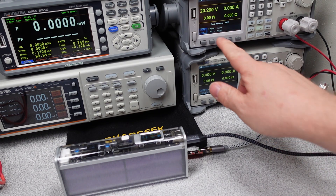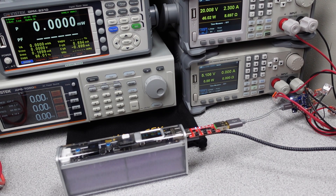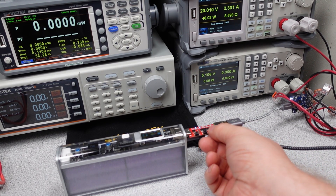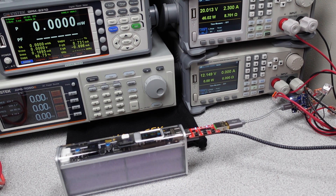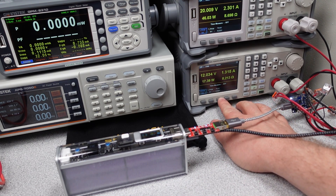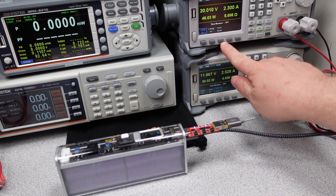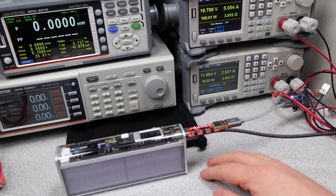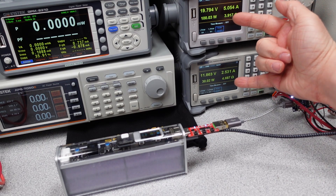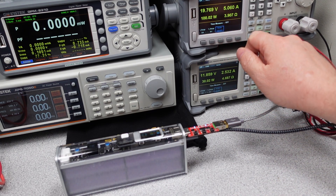This PowerBank has two USB ports for output and one shared port for input. The USB-A port supports various protocols — most popular are the Quick Charge, or QC, modes, which get you a maximum of 30 watts. The QC port has 5, 9, and 12 volt modes. The QC port is independent of the USB-C port and is active whether the other port is charging, discharging, active, or not. There is no renegotiation with this PowerBank, and it does support pass-through and does not interrupt power, so this can function as a UPS — only a 30 watt one, but it can do it.